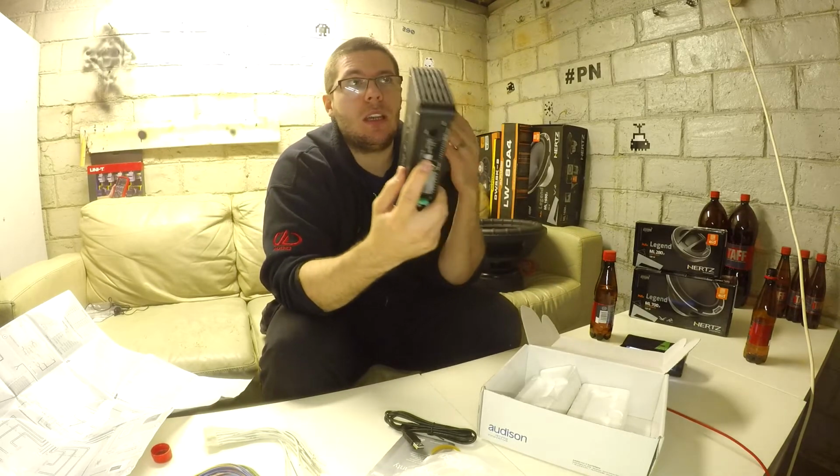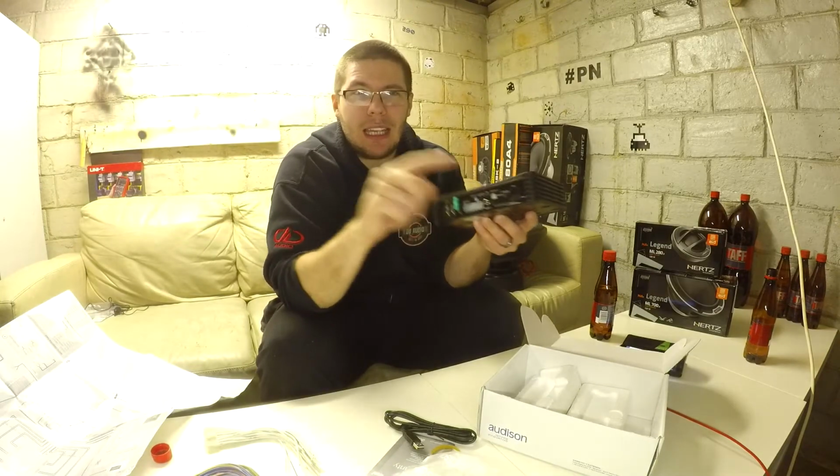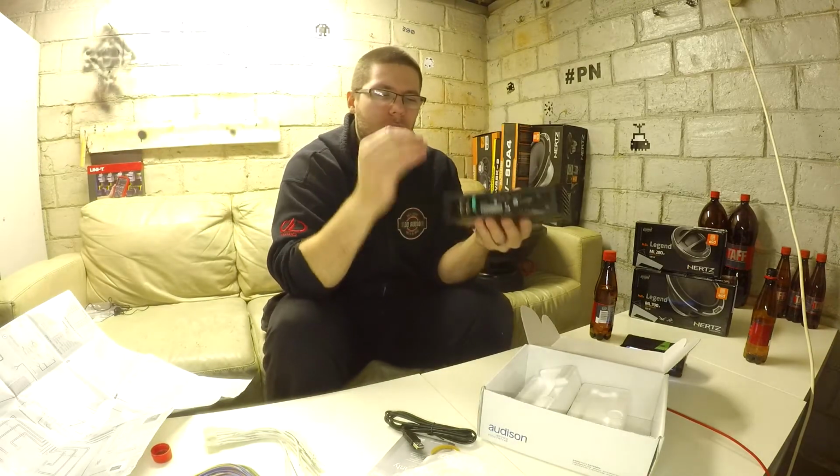Other inputs here are optical inputs. Now, let's say you can put a Raspberry Pi with a module here, so you can make your own CD player, your own player with Spotify or even 3G and navigation and everything with this Raspberry Pi. With the module you can get an optical out and put a Toslink here, so you can have very high quality sound directly in your DSP before it goes into the amplifier and out to the speakers.